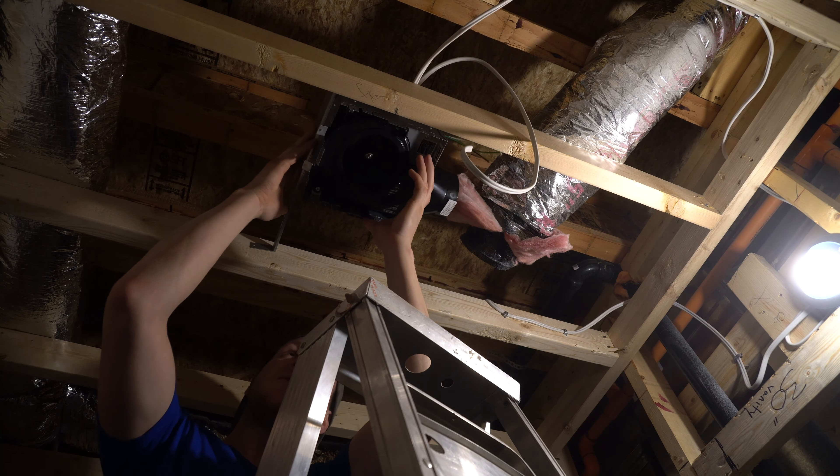If you're doing this at home and you have an activated circuit, you would want to turn off the breaker, or at the very least make sure your light switch is turned off. You see we have two grounds here — one to the box and one to the connector. Put it like this, then bring it up here. Put your wire nut on — make sure you get all three tips. Once you get a good bite you should feel all three of them twist.